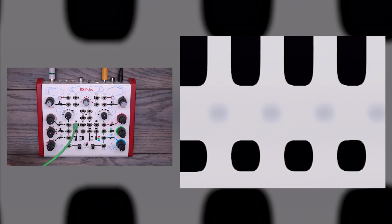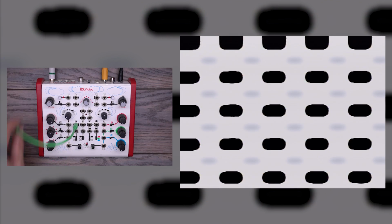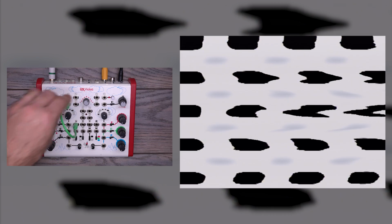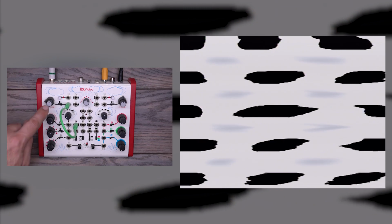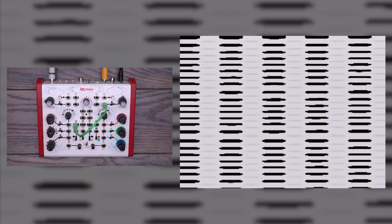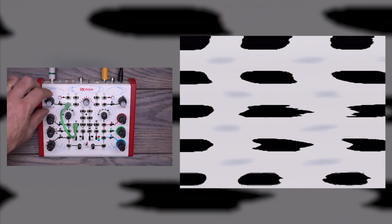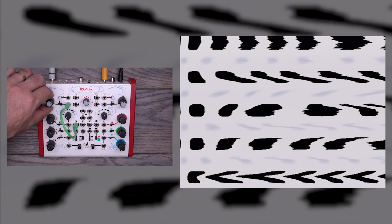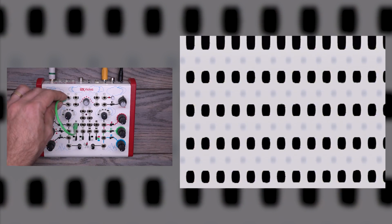So I'm going to go up just to look at our basic pattern here, black and white oscillators. I could take this camera output and use it to apply frequency modulation to my oscillators. This is going to work better with your vertical rate oscillator. And so for this oscillator, I really have two options. Do this, which looks pretty cool, or I could use the external video to actually sync the oscillator.